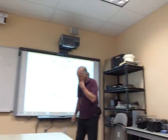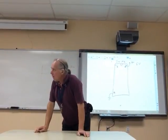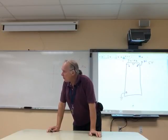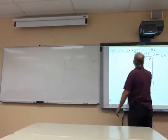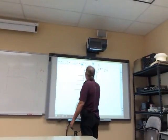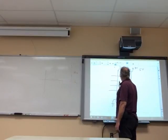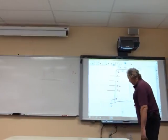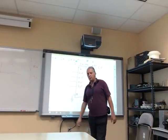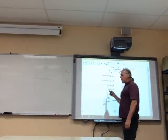All right, now, the main thing that we need, well, we got power. We need to be able to output a 4-bit word. Okay? So we know right away that it's got to have 4 outputs on it somewhere. I believe they are Q0 through Q3. Is that not correct? QA, QB, QC, QD. Okay, that'll work too. So we'll put A, B, C, and D. You may see them with number designations also. So, all right, those are the outputs.